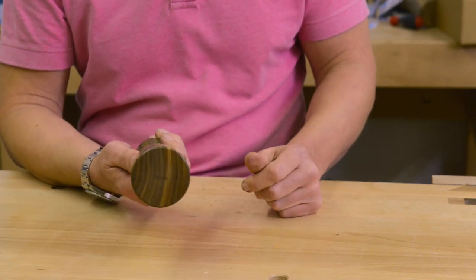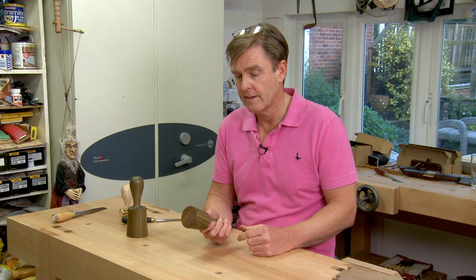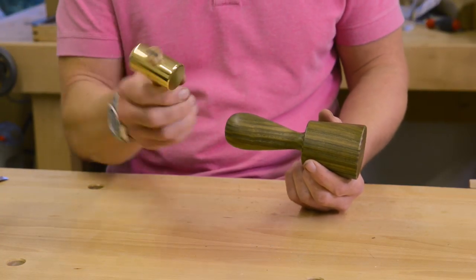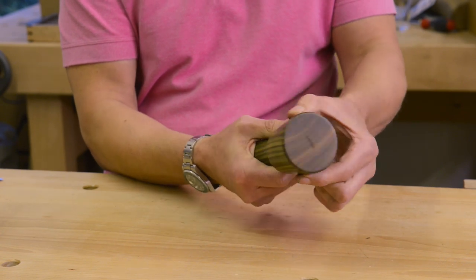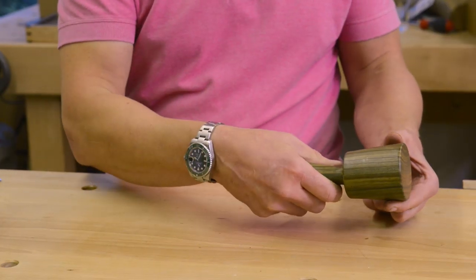This small one here, even though it's only six and a half inches long, it weighs 12 ounces so it gives quite a whack. The design borrows quite a lot from my chisel hammer. The teardrop shape works a bit like a ball and socket, so instead of lifting it, the mallet actually swings in the handle — you're not lifting it an enormous distance from your work, so it's likely to be more accurate.